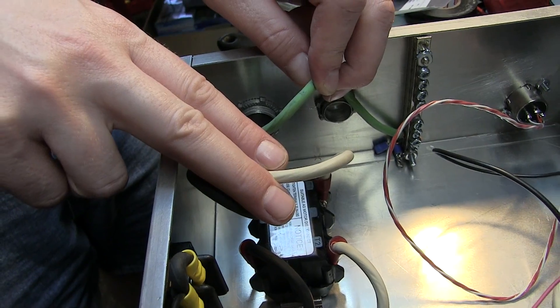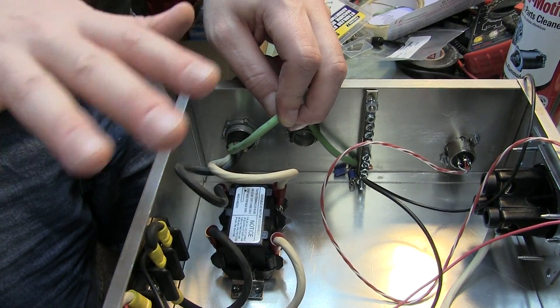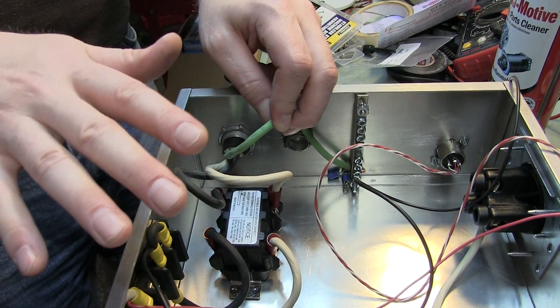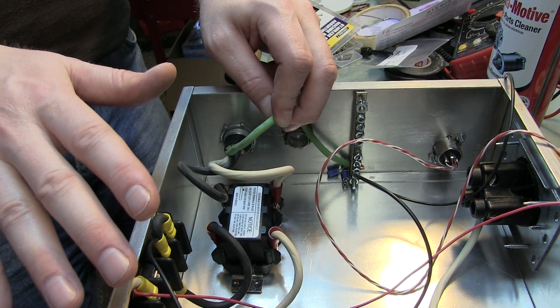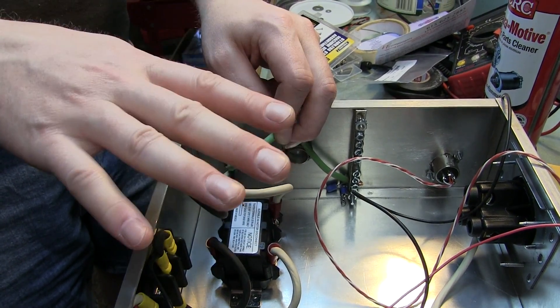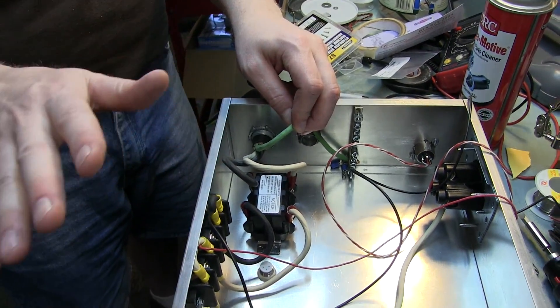The difference is with a four-wire, you can safely tap off a 110 leg from this and still be GFI protected. Any electricians or electrical engineers out there can completely comment and point me out as being wrong. The code in the U.S. is you're not supposed to tap 110 off this unless you have a four-wire, so you have both neutral and ground so that a GFI will work and save your life.